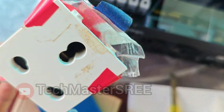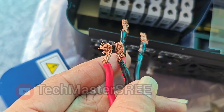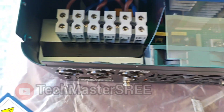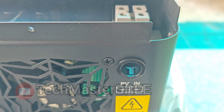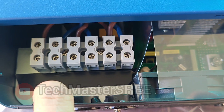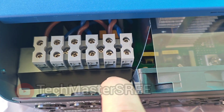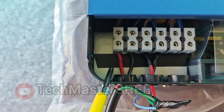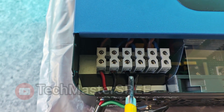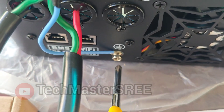Since it's for testing purpose, I'm just using a 16-ampere socket for output, and I have not used terminals on these wires. When you use it, please use proper terminals and proper output connection methods. I've used insulation tape to prevent the wires from touching the metal parts. Since this inverter supports higher VOC like 500 volts, six or four square mm wire will be sufficient. Always make sure you have properly connected body earth when using high-frequency inverters, otherwise you may get a shock from the body.